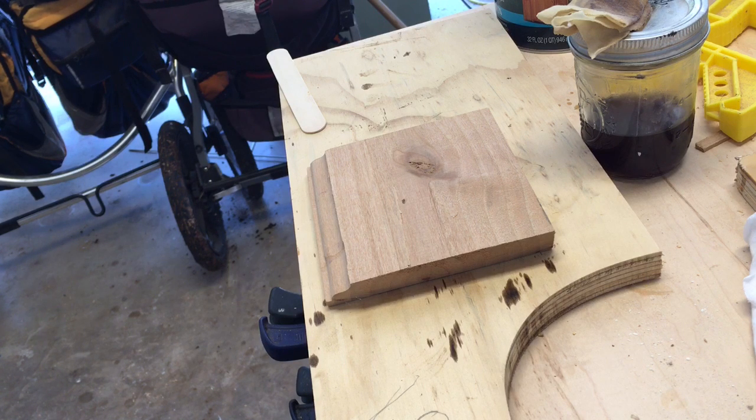We're just trying to show that there's some other alternatives out there, like epoxy, if you want to seal up your wood and protect whatever it is you're building. Now this stuff does not have any UV protectant, so it will require some sort of varnish on it if you're going to have it outside. But it does the job of varnish, as far as it looks anyway, but it does it a lot quicker. It's a lot thicker than the initial coat, and it'll be a lot harder, probably more durable than any other finish you can put on it.